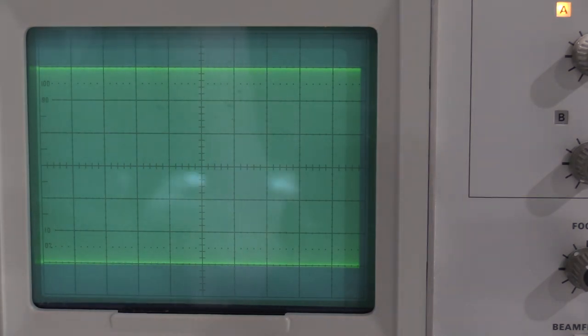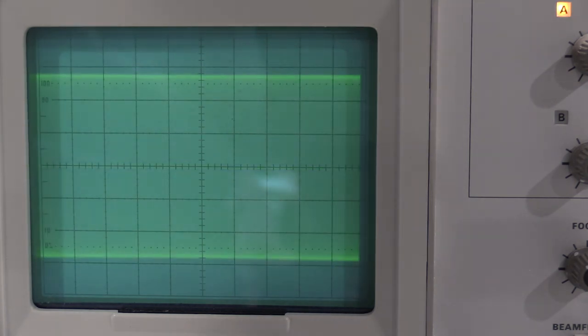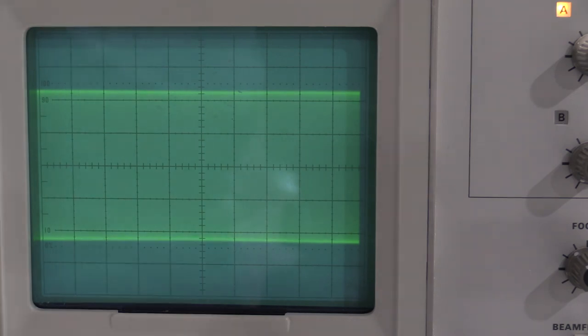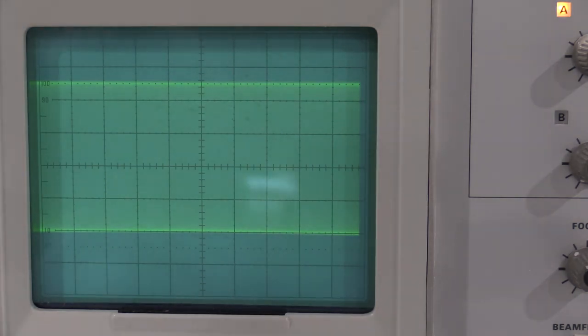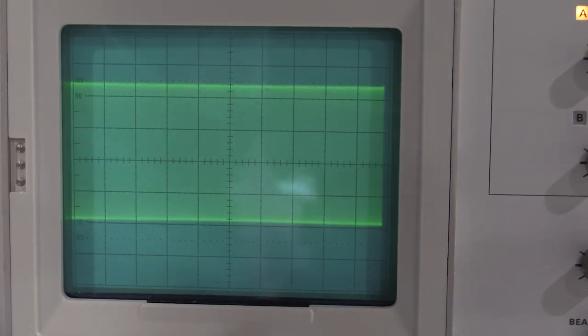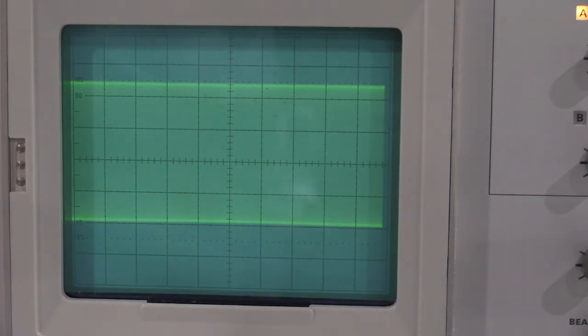There we go. Now, because we're on a 900 series, we need to be better than 200 megahertz because it's a 7904. So, we're going to wind it up to 200, and we need more than 4.2. That's 200. So we have 1, 2, 3, 4. We have 4.5, so we're actually good. So let's keep winding it up and just do a bandwidth check. It's about 4.2 right there, so the 3 dB point of channel 1 is actually 220 megahertz, so that's perfectly healthy.